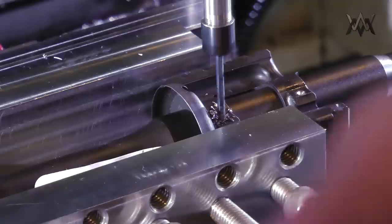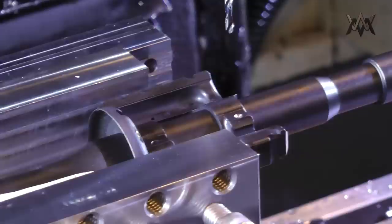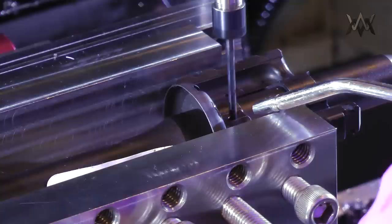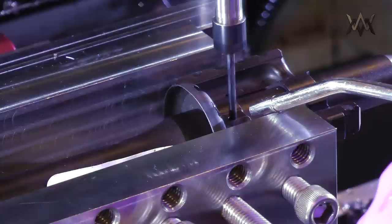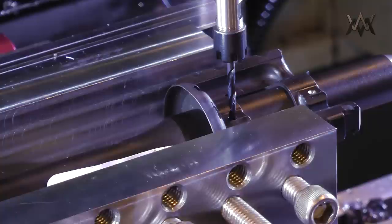But that's a carbide drill, and that pretty much broke the tips off. So I put in a replacement and I tightened it down as best I could again. And then I'm trying air here to see if that helps anything, because the oil just kind of tends to make the chips hang around. It's just that collet can't hold that drill tight enough no matter how hard I torque it down. So I need a smaller collet for sure.